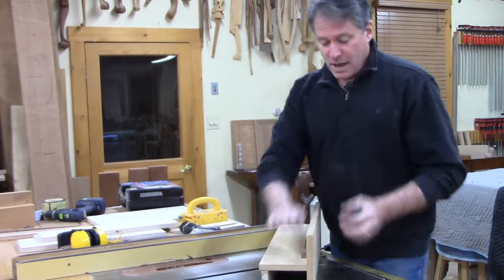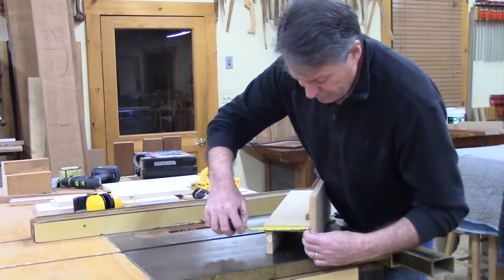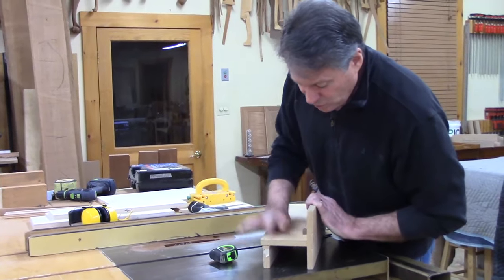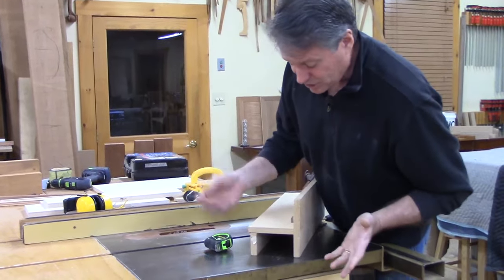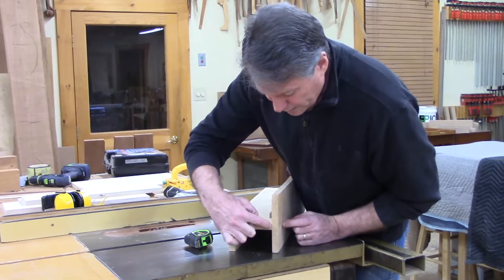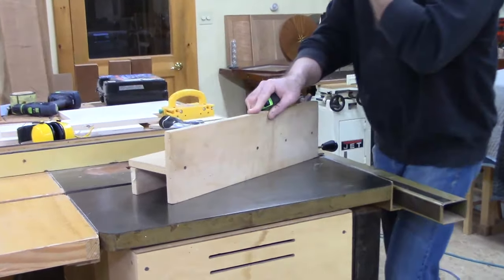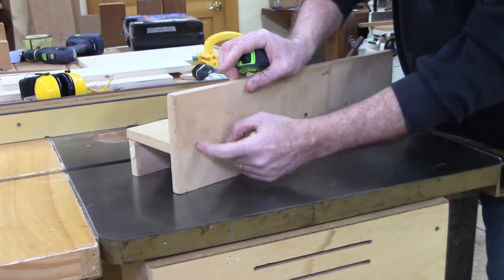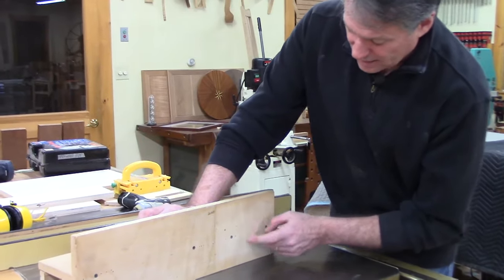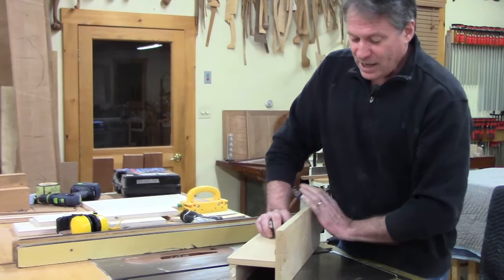And then I'm going to need a horizontal piece. And this is going to be right about five inches wide. I'm going to build this one a little bit differently. This one I made kind of quick and dirty, and it actually functioned really well. But you can see the plywood comes over, and it's just a butt joint against the other piece of plywood. And with the butt joint, all I did was pre-drill for some screws, and I screwed that in. So I've got these little brads in here, and that holds it, and then I ran the screws in. So that held up quite well.